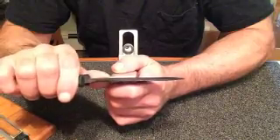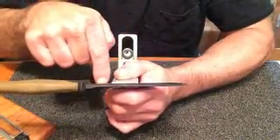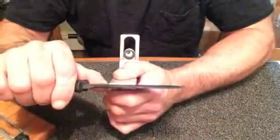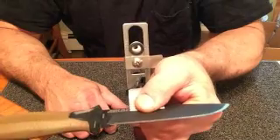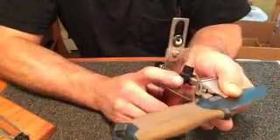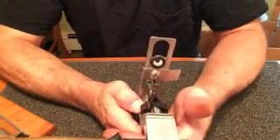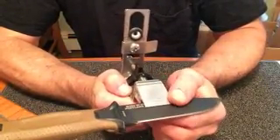You want to be looking straight down on the knife. I can see the back spine of the knife and how it's lined up in relation to the lines on the jaws. When I have it right where I want it, the most important thing is to pinch — top and bottom, right at the very front of the jaws. That causes each jaw to conform to the shape of the knife, whatever shape that might be. Then snug: just spin the knob while you're still pinching, snug it up as well as you can.